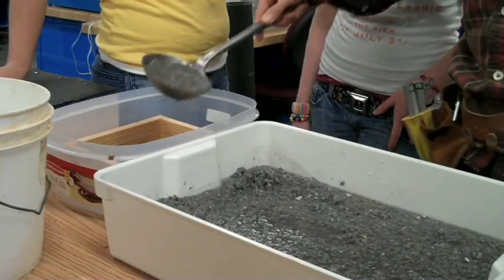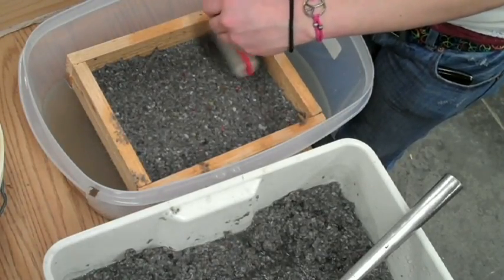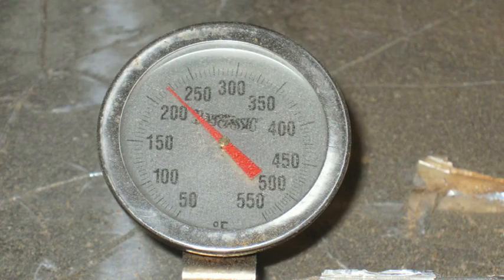I'm Brady and I'm Tina. We wanted to find out how quickly some of these typical construction materials and insulation absorbed water. This is called the water vapor transmission test. We dried out all the samples in an oven to a very low relative humidity and weighed them.